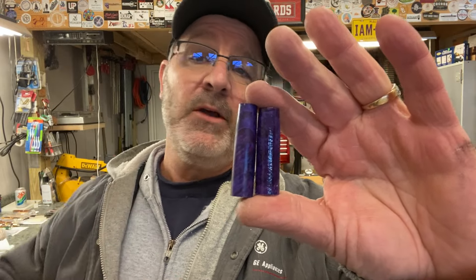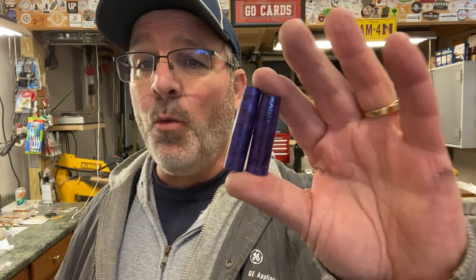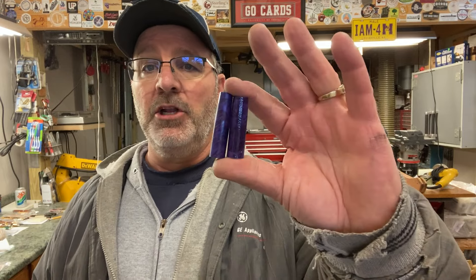I think the problem — there was no issue with the blank whatsoever. This is a fantastic blank, and I would turn one of these again in a heartbeat. I have another one over there on my bench that is orange that I'll start working on. The issue with this one was instead of turning between centers from the get-go, I tried to turn on a mandrel, and you could see the wobble in the video. My mandrel evidently has a little bend in it, so we're going to get rid of that mandrel. I'm going to buy a new one because I sometimes like to turn on mandrels, especially for a double barrel pin — sometimes it's easier to turn and finish both together, it's a lot quicker. However, this is what I've been doing with these cigar pins between centers, and it's been working fantastic. I tried my best to finish it — you can see just a little bit of brass tube there, but I'm not going to attempt to fix it. That's it for me on this one. Sometimes you win, sometimes you lose, and today we lost, so we're going to move on to the next one.